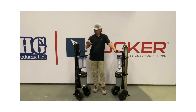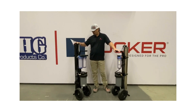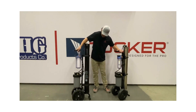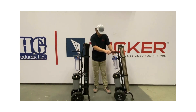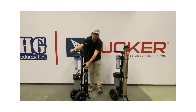In terms of fit and finish, we're utilizing standard plastic push-fit fittings on the Rival cart, which keeps the cost down for us and the end user. On the S4, we have metal fittings that are much higher quality with a much longer service life. The S4 also has a built-in pressure gauge so you can see what pressure your system is operating at — that is left off the Rival. On the Rival, there is a bypass waste valve that is essentially held in place with zip ties on the frame.